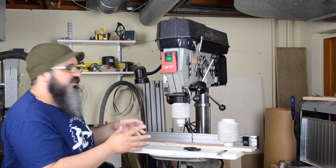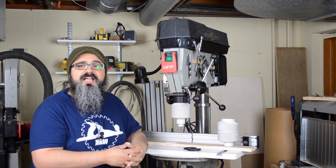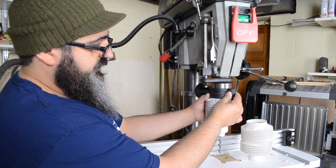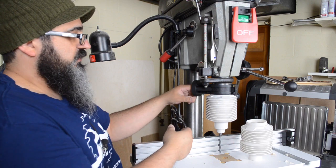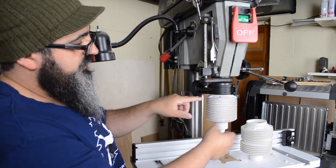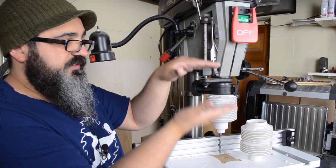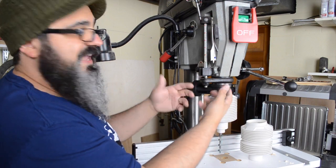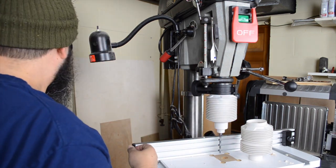That's really the whole gist of the Drillnado — let's come in here and talk a little bit more about the collar, getting it in position, and see what it actually does when we start drilling. Putting the Drillnado in position is really easy. I already have the sleeve attached to it and we're just going to slide it up onto our quill. One thing the manufacturer recommends for the best dust collection is having the collar just a little bit down from the top. If we remove the sleeve, you would see where the dust port comes in — it should be just below the quill so there's enough room between that and the top of the chuck that the bits will just get sucked up in there.